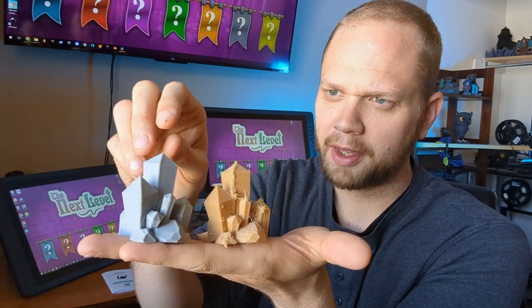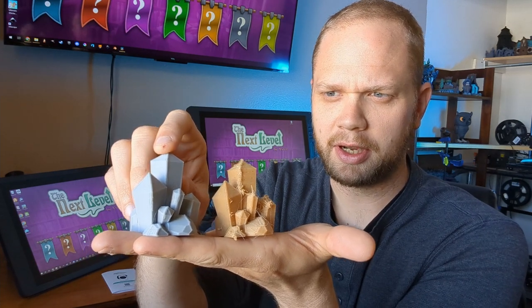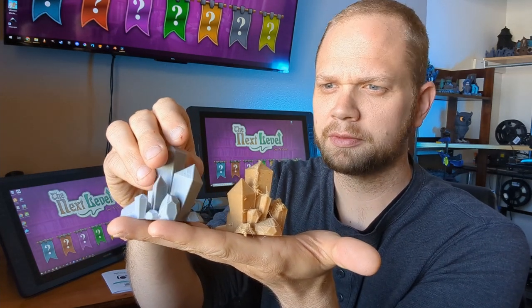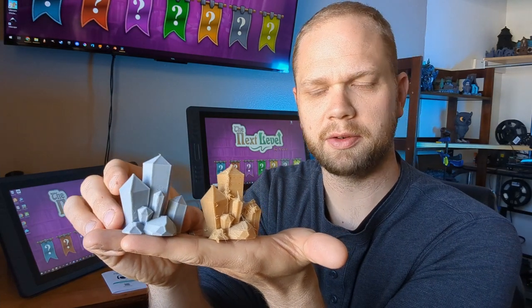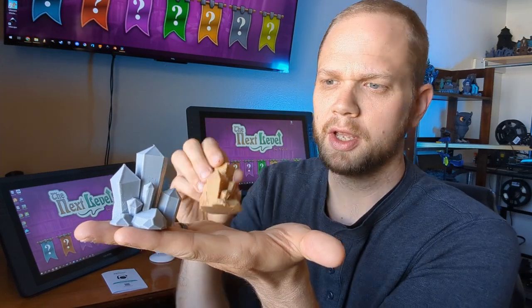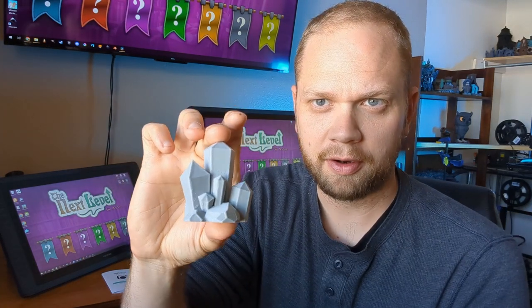On top of that, I did lower the nozzle temperature. I think I dropped it down to 205, and that seemed to help a lot. I also increased the retraction by just a little bit. These are all suggestions that were on the Mintion website to improve the results of stringing caused by the time lapse. So that definitely fixed it for printing that crystal set there.